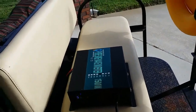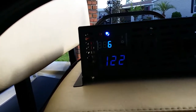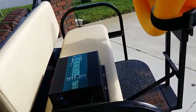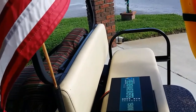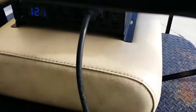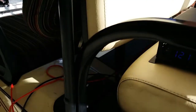So I'll turn it on, and there it says — you can see on the display there — it's got 56 volts on my battery off the golf cart, and then 121 volts at the output. It's got two electrical outlets there. So it actually delivers about the same power as a regular electrical outlet in the house, rated at 15 amps or 1500 watts. And I plugged in a good old DeWalt drill, and it's got plenty of power to run a drill.